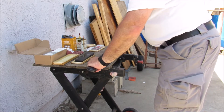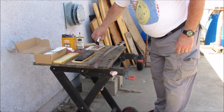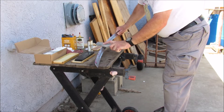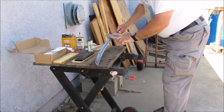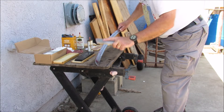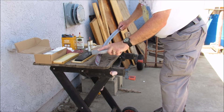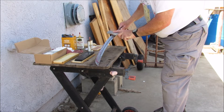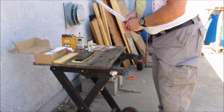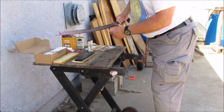That was ten strokes. We flip over and do the other side — same number of counts again. A little oil on the stone. I use my thumb to stabilize the blade. One, two, three, four, five, six, seven, eight, nine, ten. I just do ten because I can remember ten at a time. And this is where I do a little test — it scrapes my nail. Yes, it is sharp.